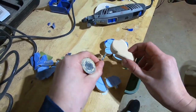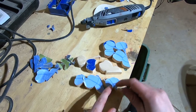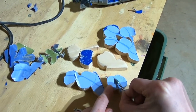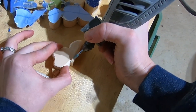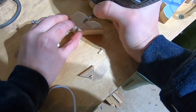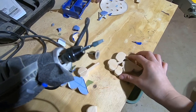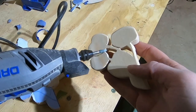When it comes to shaping these, I've taken the disc sander and gone around the edges, making the bottoms round down and the edges as well. For the stems and the lines in the middle, I'm using this little engraving tool. There are other tips you can choose — you can try something else. This is what I'm going to use to make these lines a little thinner at the top and a little thicker and wider at the base to match the size of the stems. This small engraving tool is also nice for the little tiny spaces where none of the sanding bits will actually reach. So just on the inside cuts, it's nice to be able to round those edges over with this little guy.